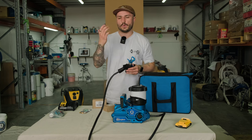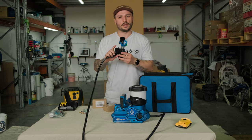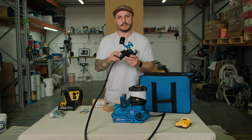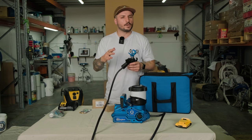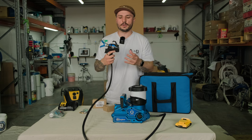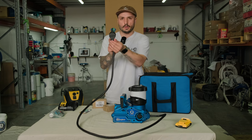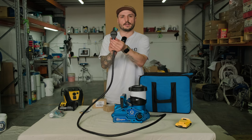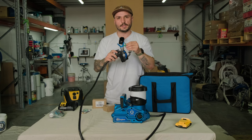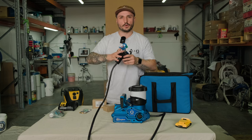This gun will reduce spitting while also being the most flexible and portable in its class. If you're used to traditional spraying with a larger trigger, it feels a little different — but this is the world's lightest trigger pull in an airless spray gun system, and once you start spraying you get used to it and it feels pretty natural. The cool thing about having all the electronics in the handpiece is you have on-demand precision flow control through the dial at the back, allowing you to adjust pressure up and down.